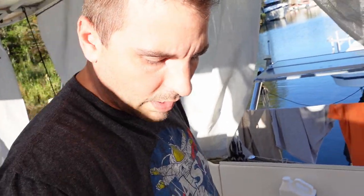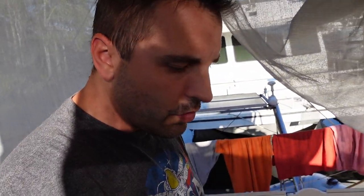The finish is looking pretty good but it's not perfect — right here is where I had the most bubble problems; the surface is quite a mess. But that's okay because I knew I'd likely do two coats of epoxy, sand it again, and then put a polyurethane on — probably the Minwax Helmsman. The epoxy gives very good water protection but it's not great with UV protection. The Helmsman has excellent UV protection, so I'll sand this again, coat it one last time with the Helmsman, and then we can finally get the table installed.